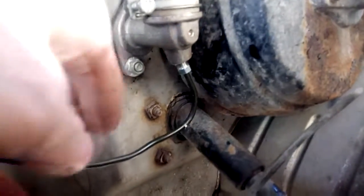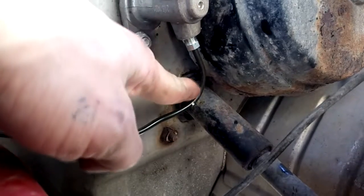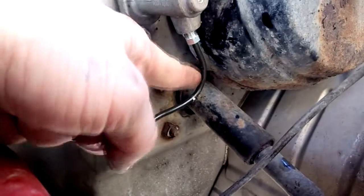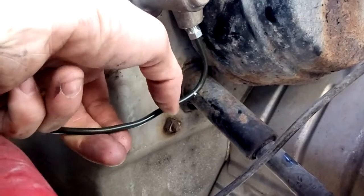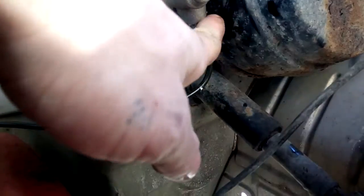Alright guys, so I got it snugly in there as you can see. I've just been bending it by hand. If you want to do sharp bends like this, it's better to use the bender because you could kink it if you're using your hand — if you use like the point of your thumb or whatever, as you bend it it could kink. So short little bends like this it's better to use the bender.